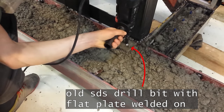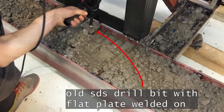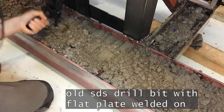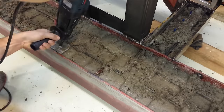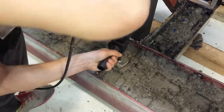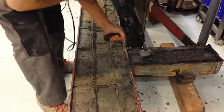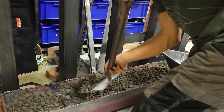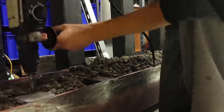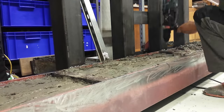If you're on a building site making a slab or foundation it would be just unmanageably dry with a lot of swearing, but because we're making such a contained specific shape here we can give it the attention it deserves and really consolidate it down well. All this is in service of making it as dense, stiff, and strong as possible. To fill the whole side of the profile took a good number of full mixes in the cement mixer, and each layer gets very well consolidated before moving on to the next.